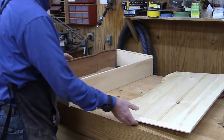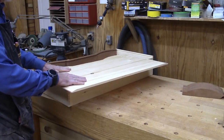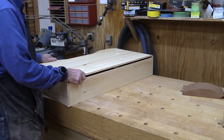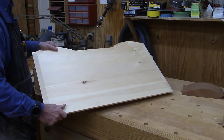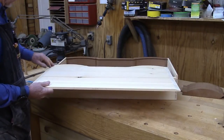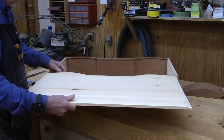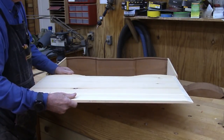Once I've done that, I had the bottoms, which were glued-up pieces of pine — three pieces with two glue joints — and of course it was rectangular to start with. So I would lay it on top of the drawer like so, trace the front on the inside, and then cut it out with a jigsaw or bandsaw. Then I put a bevel on the bottom — about an inch, inch and a quarter, all the way around. I did that with a router bit. You could do the sides on a table saw, but you can't do that curved front on the table saw.